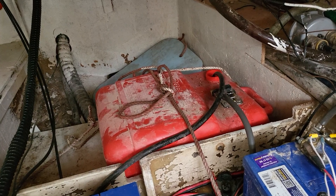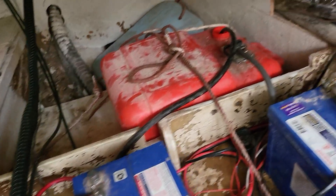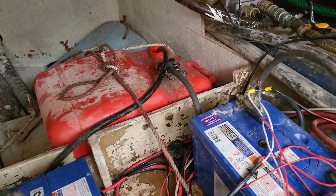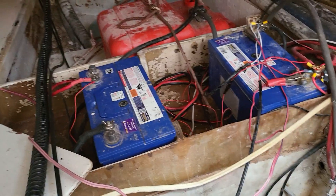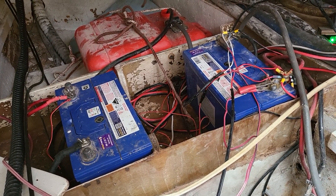About quarter past three high tide tomorrow, so that's when she'll be going back in. My leaks are all fixed. The engine is definitely ready to go. I've put a temporary tank in there with the return line going back into that tank. All my linkages are hooked up into the cockpit now. I've got both batteries back up under the cockpit so they're not likely to get wet again.